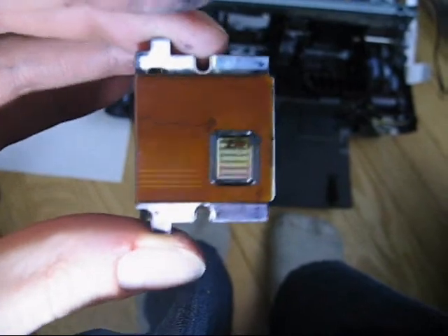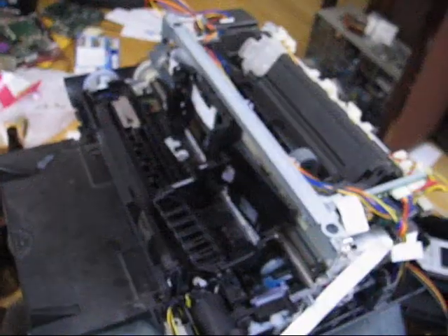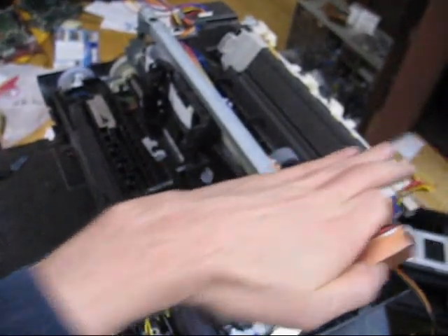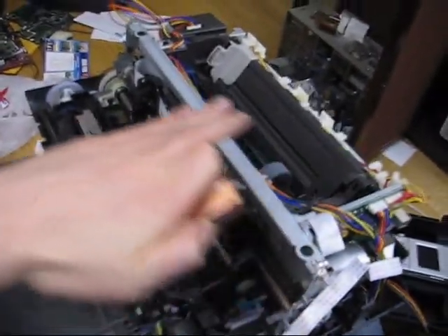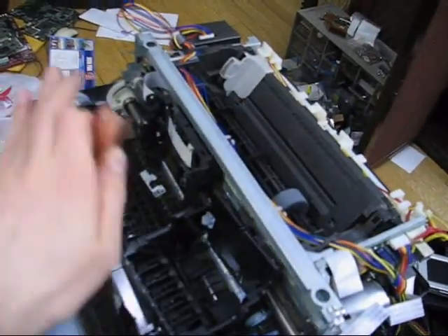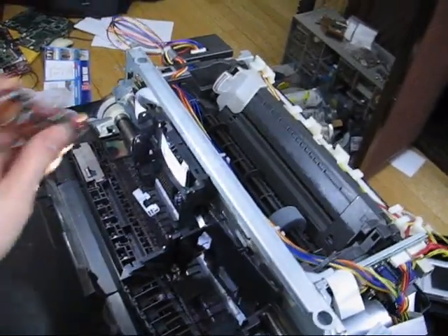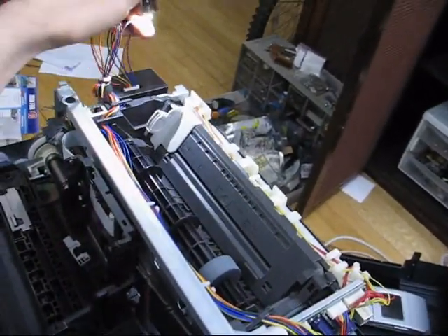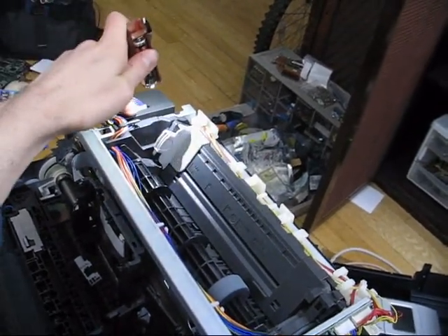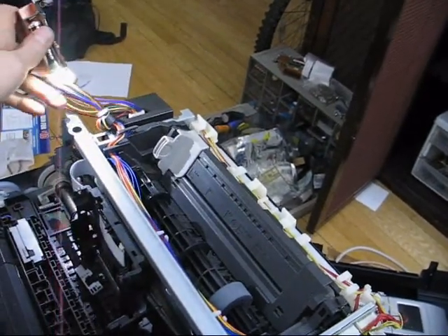As far as what actually caused it to fail, I don't know — it doesn't look like there's anything else failed, so I could probably still replace this. As long as I've got it open: I've got the cover off, there's the front panel right here, and just another side panel over here. There are little flaps on the top cover that open for paper and maintenance access and replacing ink. The power supply is a module right here with a cable — the pins are labeled with voltages and current ratings, which is really cool. The cable has a ferrite bead and comes back to here.